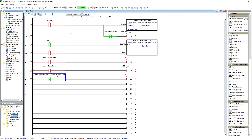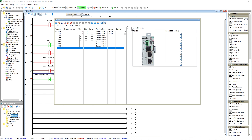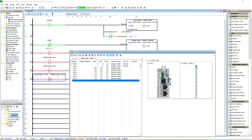If you want to run this on the simulator, you can literally transfer this into the simulator, hit data view, and toggle the IO view. Here's all your IO right here — you've got to put the simulator into run mode in order for it to actually work. So now you've got it in the simulator. Say you don't have a PLC at home and you don't have a trainer — you can still play around with this. Download the software, it's completely free. Write your program, get into your simulator, add some IO, and your outputs will come on.